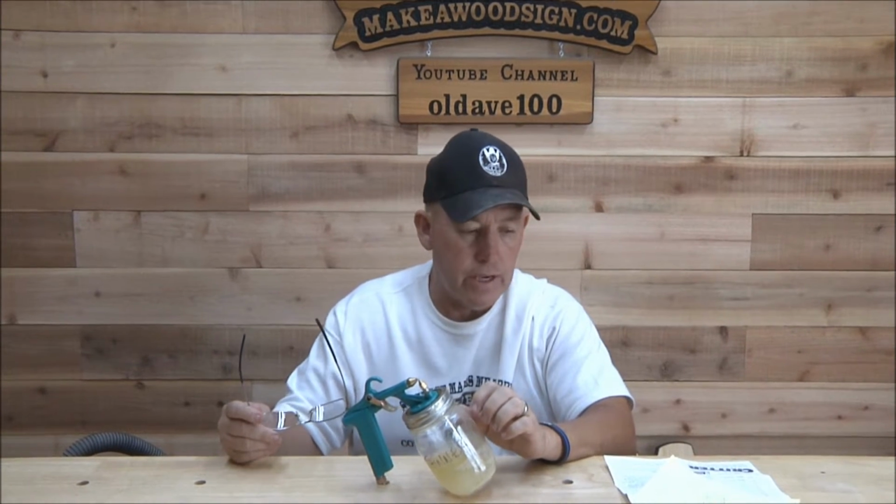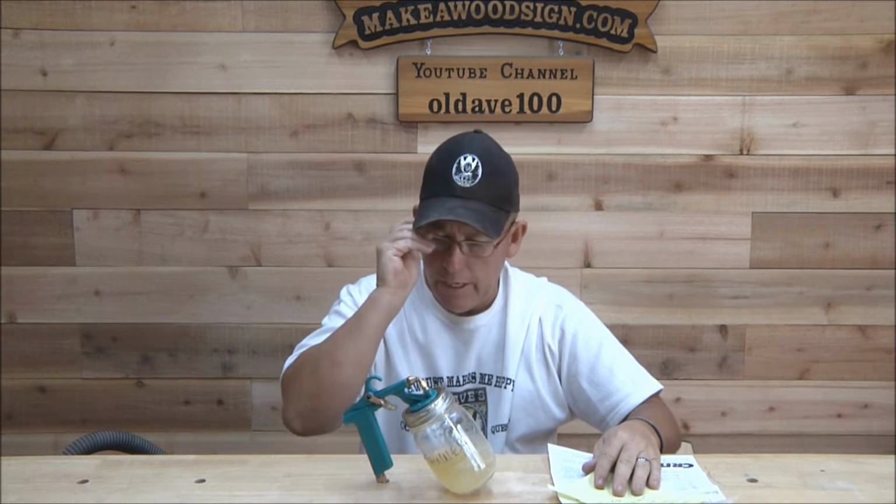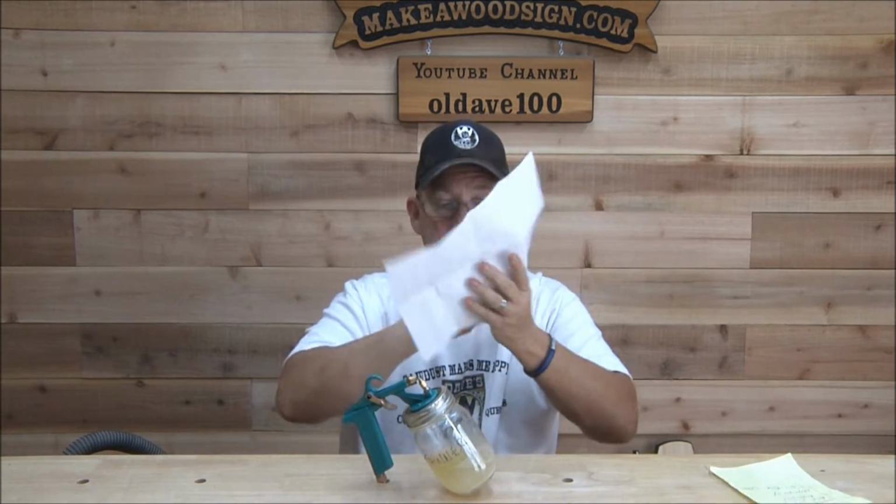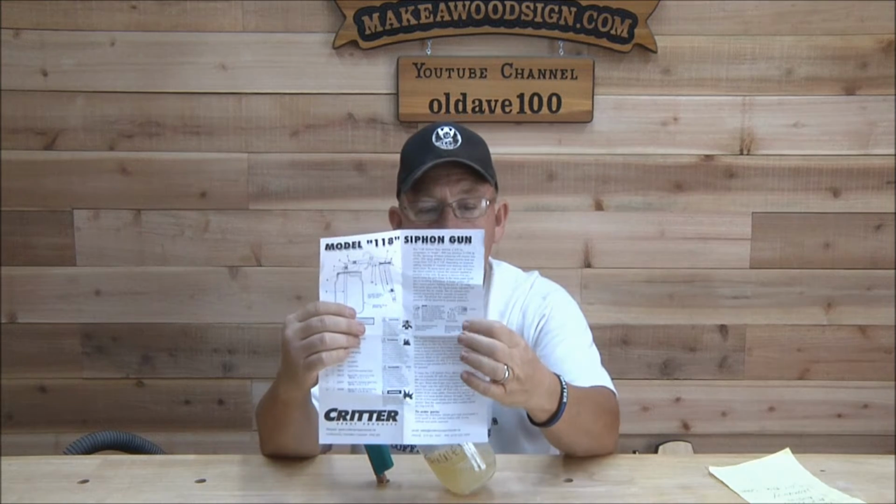It will. Huh. So I found there are some other questions that I got on this, and you guys seem to like that video and the demo on it. What you need for a compressor, according to the paperwork that comes with it, not a lot of instruction, which you don't need a lot, says you need at least a 3/4 horse compressor that can do 90 psi, which I think just about every compressor will do. So you don't need a big, heavy compressor.